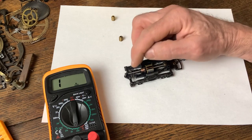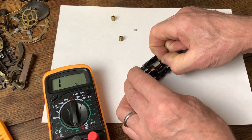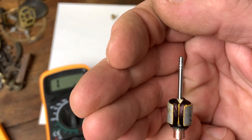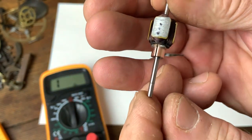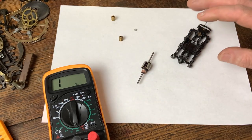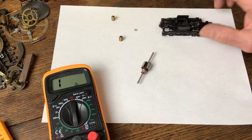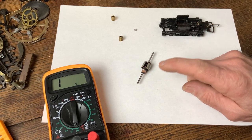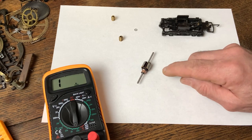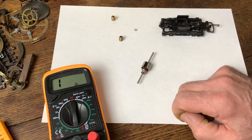I'm going to put a couple of washers each end. The other thing is the shaft - I don't know whether the armature originally came from a Class 37 or 31 - it fits fine but it sticks out too far at one end, so I'm going to have to cut a little bit off. This armature has had quite a life - if you look at the end of the shaft you can see file marks and where worms have been taken on and off. We've got some slightly damaged worms and a few challenges, but we like challenges here on this channel.